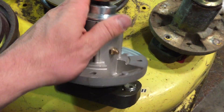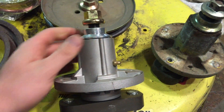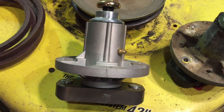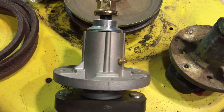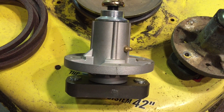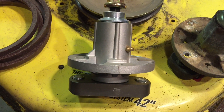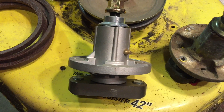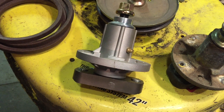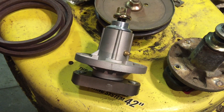This is the newer one you can get. Most of the older ones didn't come with grease fittings on them. If you order a new one, be careful and try to order one that has a grease fitting on it. The bearings will come with grease in them, but the spindle assembly will not be pumped up with grease. So you want to pump about 25 to 30 squirts of grease in until you see it coming out the top or bottom side — then you'll know you've got that thing packed full of grease and it'll last a lot longer.